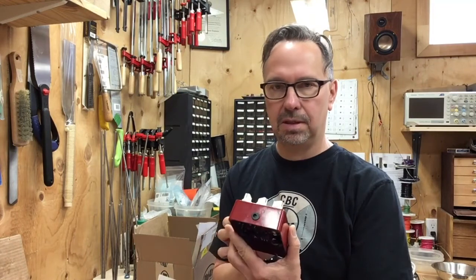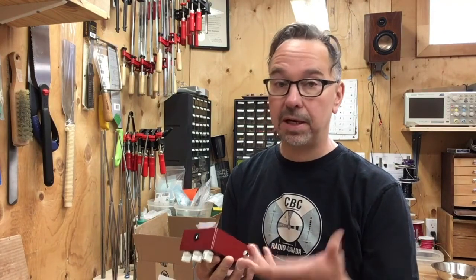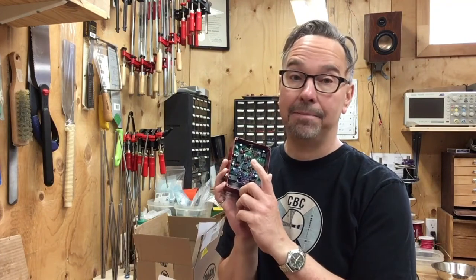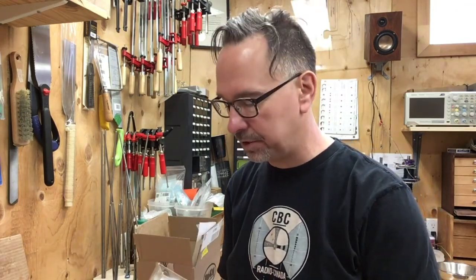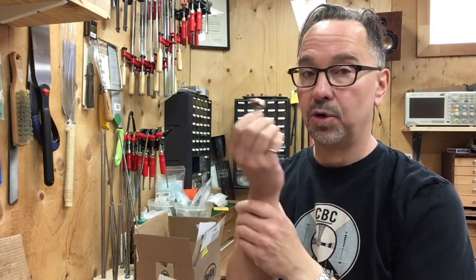So in my perfect world, I would like to have that with a variable resistor on it so that I can change it. But I don't want to spend money or drill holes or do anything crazy until I make sure that the thing actually works. So my plan is to put a potentiometer in parallel with that resistor so I can just lower it a little bit and see if it increases gain. Going through my big stash of potentiometers looking for a suitable one, I decided it'd be nice if I could use 100K. That way, when it's all the way up, it shouldn't change the resistance of the 47K too much. And I managed to find this one. It's a bit big. The plan is I'm going to wire them with some fairly long leads, have them sitting outside the pedal so it doesn't rattle around inside there, and see if it works.